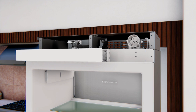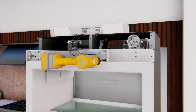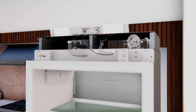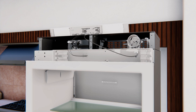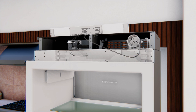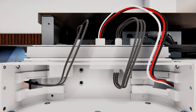Lay the glass assembly on top of the control housing. Then, using a ¼-inch hex bit, remove four screws — two on each end — to remove the housing assembly. Move the housing assembly to the opposite side and install using four screws, two on each side. Make sure wires do not get pinched. On an 18-inch model, the red, white, black 5-pin wire connector needs to be removed from the control board and routed through the opposite quarter bracket and reconnected to the control board to prevent pinching the wiring. Snap the glass assembly back onto the control housing assembly, ensuring plastic pins snap into holes on the side of the housing.